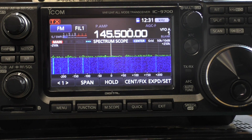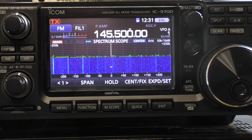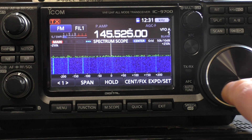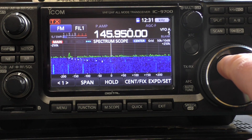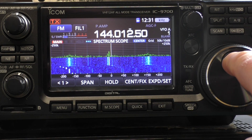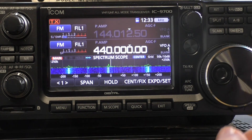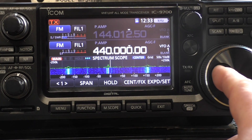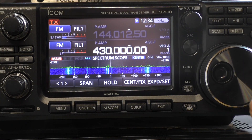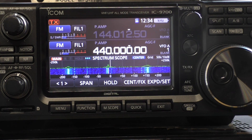There is a slight extension, I believe, to the 70cm band from 440 to 450MHz. I don't think it modifies the 23cm band at all. As it currently stands, if we get to 146 we drop straight back to 144, so we're going to look at extending that. The current default for the 70cm band is 430 to 440, and the extension will take it up to 450.